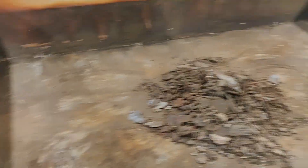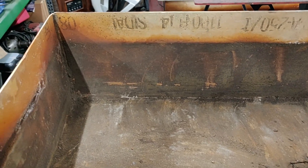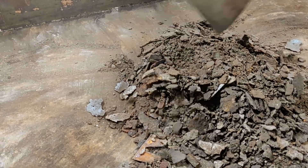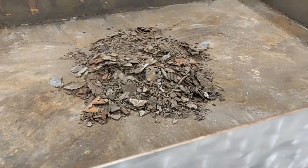I decided to do my water table clean out. I used one of these welding magnets here for the cleanup and pulled all the bigger pieces out. This is all the stuff I scraped off the bottom — all this flaky stuff. I scraped it up off the bottom with a putty knife and into the garbage it'll go. Looks like the water table is doing its job and holding up quite well.